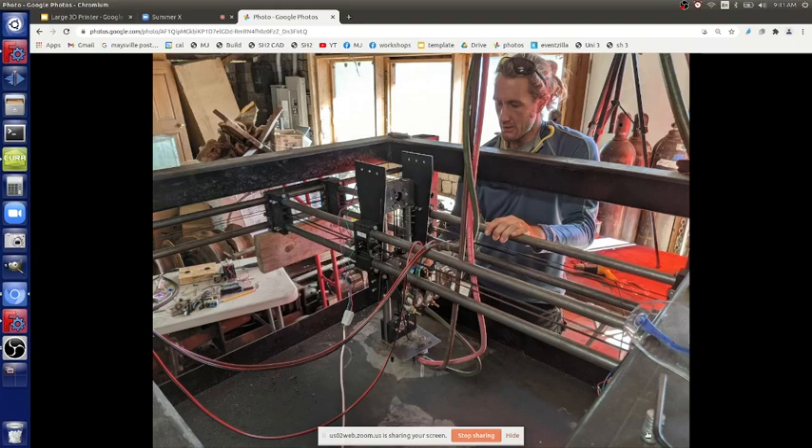We've got smooth cold-rolled steel rods, which are a little smoother than standard hot-roll steel. We've got oil-impregnated one-inch bushings designed for low friction. Bronze on steel gives a coefficient between 0.08 and 0.3 - 0.3 being worst case without lubrication. With lubrication and some diesel or other lubricant, we're expecting good motion.